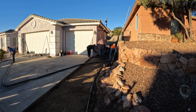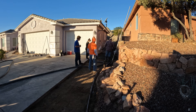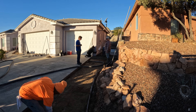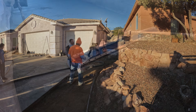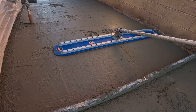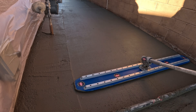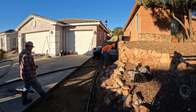That gas line has a sleeve around it too, so I didn't really have to tape it. Sometimes I'll put foam around the gas line or box them out if they don't look too pretty and they've been there a long time. But this one had a nice sleeve around it, so that's going to protect that gas line from the concrete shifting and trying to break it off.